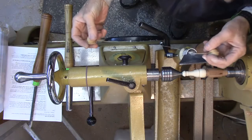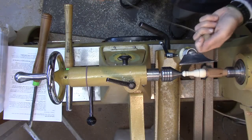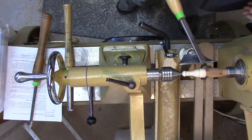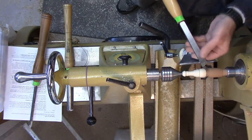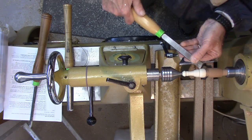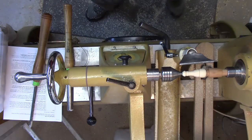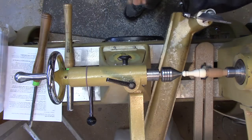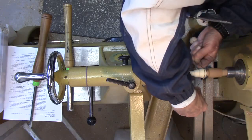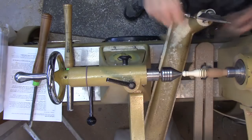I'm going to use a burn wire — I use a guitar string. You can use copper, picture hanging wire, just about anything. The key thing is put handles on it. Don't wrap it around your fingers — you don't want to lose a finger. We're going to take a skew and make a couple of little rings for it to glide in while we're heating it up. You don't have to use burn rings, but you can see them from a distance — they're a nice little feature. High speed so it builds up enough friction, then hand over in the back.